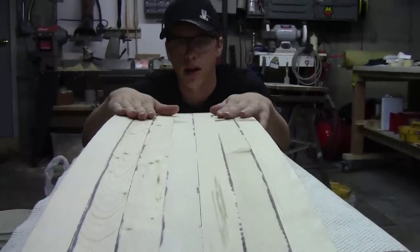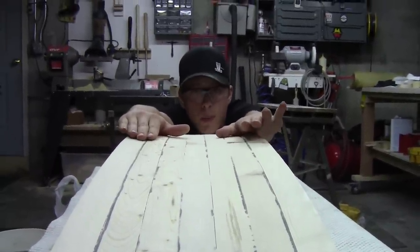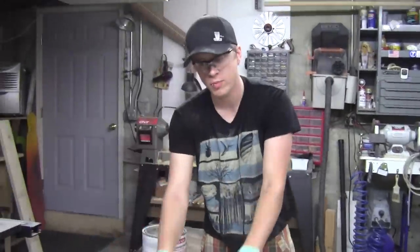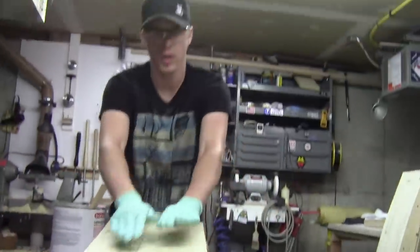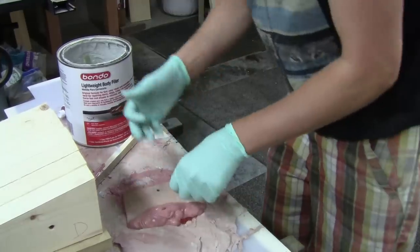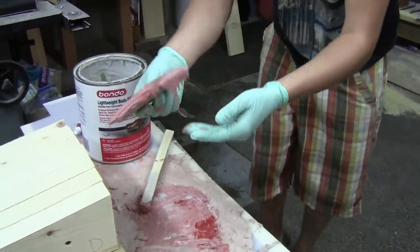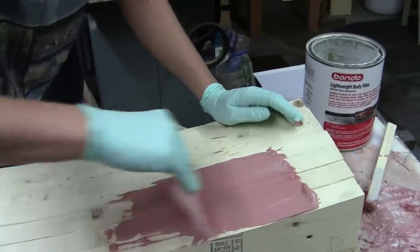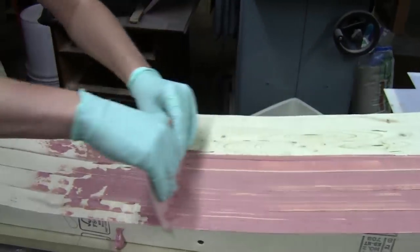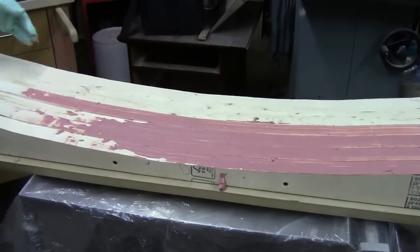Now that we are done with this, we are going to go ahead and work on the top, which instead of sanding, we are going to be using Bondo or any other body filler to do the opposite and fill in the cracks. Here is the top of our jig — once again it is the opposite: the top is the highest spot, the bottoms are the lowest spot. I am going to use Bondo just like wall putty, filling in all those seams so you can get that nice curve. You are going to do a few coats of this and sand it out to make that really nice concave.